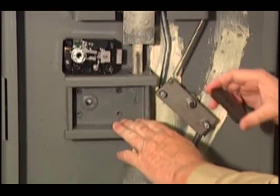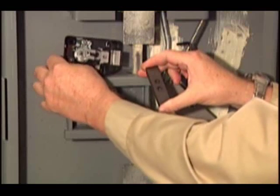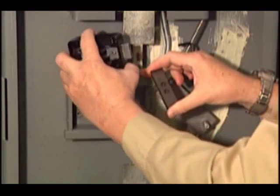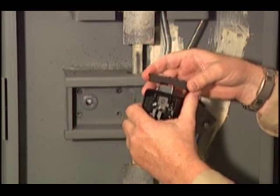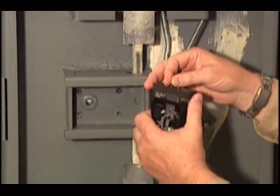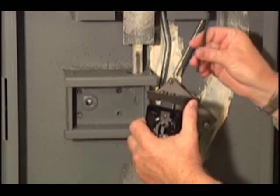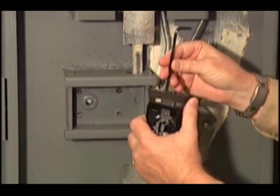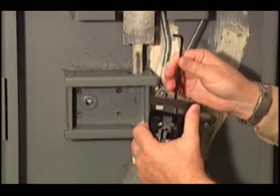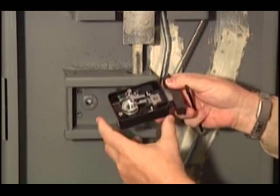This particular container manufacturer uses a bolt extension attached to the combination lock bolt. We can see that the end of the lock bolt is drilled and tapped for this attachment. These are 10-32 screws. That matches the thread dimensions used in older containers by Mosler to accommodate retrofits, and those dimensions are also used by some of the current manufacturers when they require a bolt extension. We'll just tighten these two screws down, and then our extension will be firmly attached to the lock bolt.